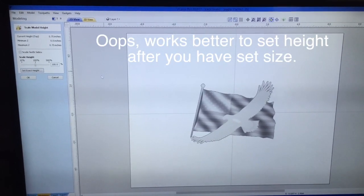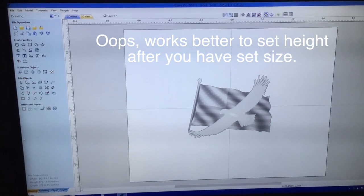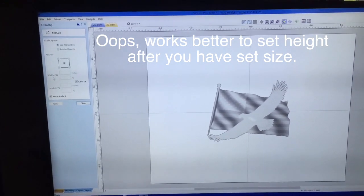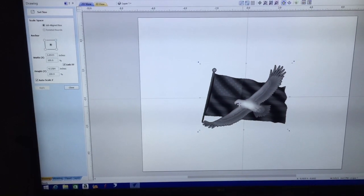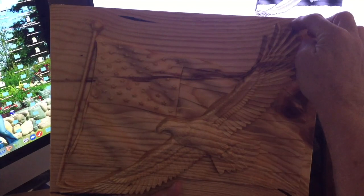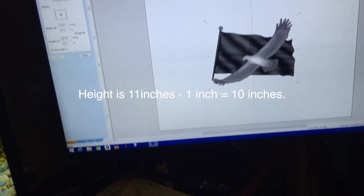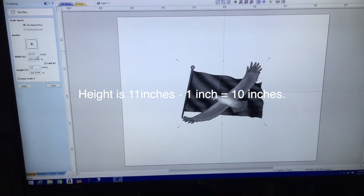I'm going to stretch it to fit, but not by just grabbing handles. I'll go back down to my drawing and come up to where it says Transform Objects and click on that. I've got to come over and click on the model to select it. It tells me the width of the model is 5.8 and the height is 5.75. I want at least a half inch in from the sides. It's 14 inches wide — but my height is 11 inches tall, so if I come in one inch from 11, it makes it 10 inches. I'll type in 10.